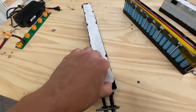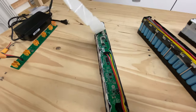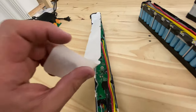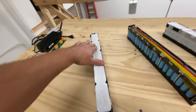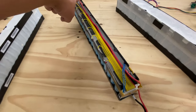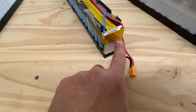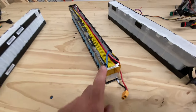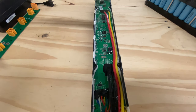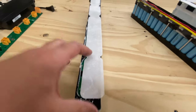In order to use them, you have to do a bunch of weird stuff, like you have to cut this BMS that is stock and that they come with. It turns out it's really well made and it's got really high-grade components, but you couldn't use it because it was off. We've been trying to get it to work for a while and we couldn't. So what we had to do was take it off and then install our own BMS — a third-party BMS you can buy on Amazon. It works, except it's a bit of work because this has all that goo in there, conformal coating, potting.